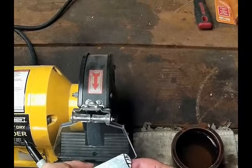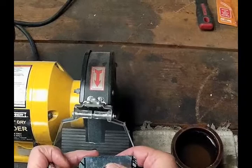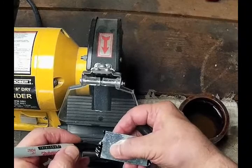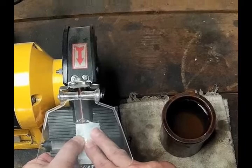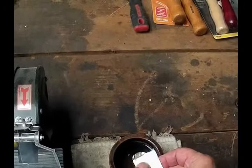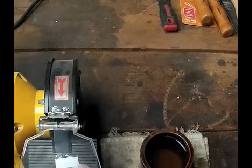I'm starting with a Marshalltown E1247 Syma scraper blade — that's part of the Marshalltown paint scraper series of products. I'm going to prepare the scraper blade by grinding away the extra metal on the ends. It's important to keep the steel cool so it doesn't lose its hardness. Grinding generates heat and that heat can warm up the metal and soften it, so every so often I'm going to dip it in water to keep it cool.